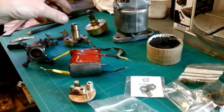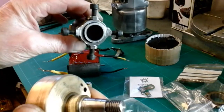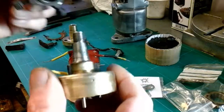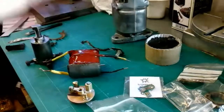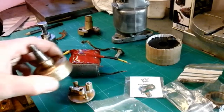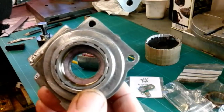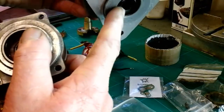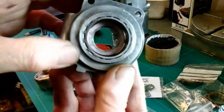Where I'm up to now — I've just removed the bearing off of this. I made a puller for taking this bearing off because it's pretty tight, so I've got that inner race off. You have to take the inner race off before you strip it down anyway. So I've got my bearings off. I've just put the outer shells of the bearings into my rebuilding of the magneto. I've put a new oil ring in — that just slots in.